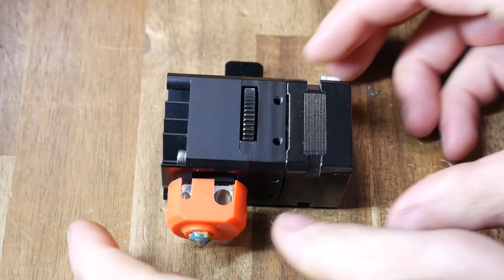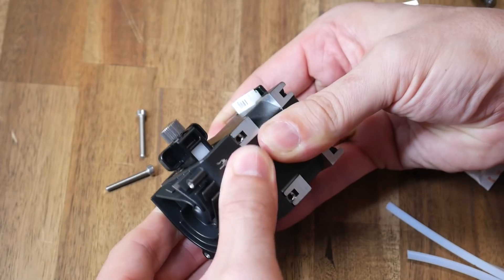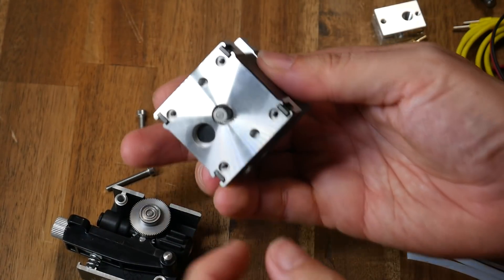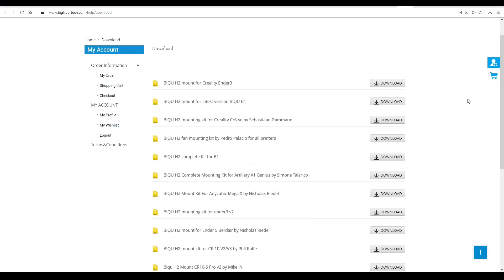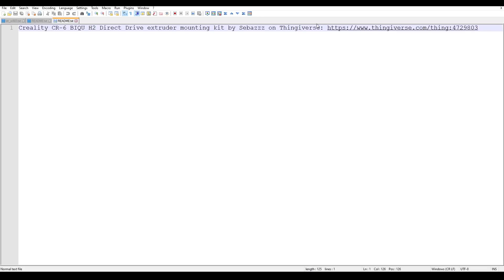Time for installation, and there are numerous options available for popular printers. One thing I really like about the H2 compared to the Hemera is the use of threaded holes on every surface of the extruder, each set exactly 15mm apart. The Hemera instead uses trap square nuts spaced 34mm apart — I find them a little shallow, and for the rear especially they do like to fall out. If you search Thingiverse it's likely you'll find some sort of adapter to fit the H2 to your printer, and the BigTreeTech downloads page also has printable H2 mounts for a variety of popular printers, properly attributed and linking back to the original Thingiverse thing.